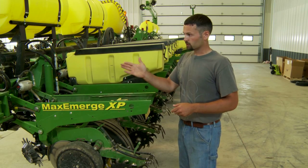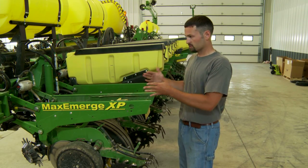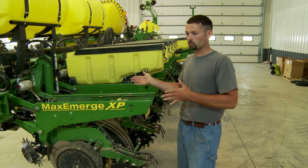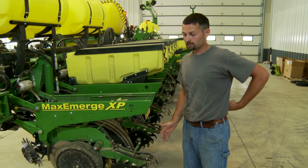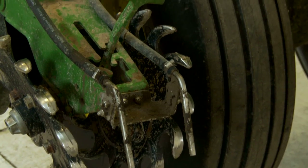Our goal is to eventually try the Don fertilizer coulter up front. This year, with a brand new planter, instead of investing in the 16 John Deere coulters, we were going to try the Don one — beta tested — but that didn't work out. So we were actually forced to try the totally tubular design. And to be honest, for something that costs 35 bucks to put it on the row, we've had really great luck with just going out the back.